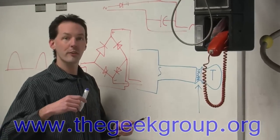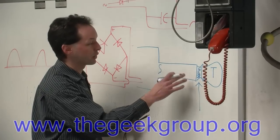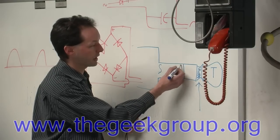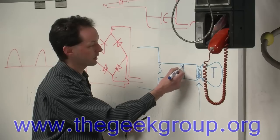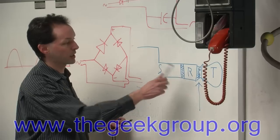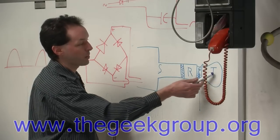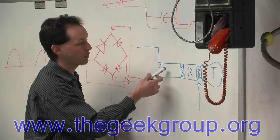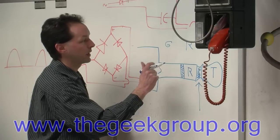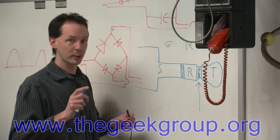If you're working with phones, remember: red right ring. If you have a stereo plug, you put a second black band here, and that's your second insulator. And then you've got tip, ring, sleeve. You'll have positive, positive, and then a shared ground between the two channels. So one of these will be left, one will be right, and then one will be ground. Left and right, there is some variation — there is a standard to it, but you want to check because it isn't always the same.